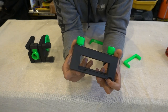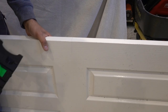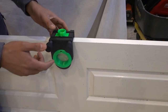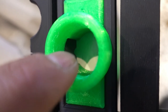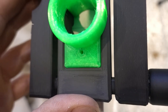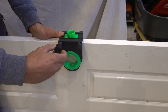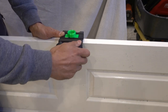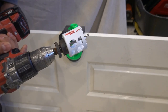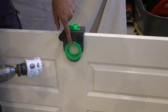I've got an old door here for the demonstration. Drop it on top — it'll accommodate a 35 or 40mm door. You can see the little V down there; line that up with your pencil marking, make sure you're 100% happy with the location, position it where needed, and simply clamp it on. We've got it set on 60mm offset, and we're going to take a 54mm hole saw and bore out the centre section.